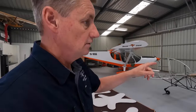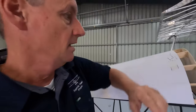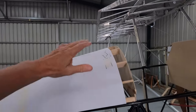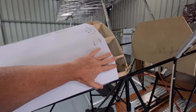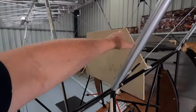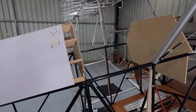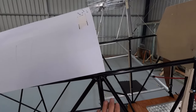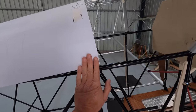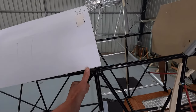I think I will try and get the plywood clipped out into place. I'm losing a bit of sleep over how to do the turtle deck. I think I might go back to sheeting this with aluminium because it's thinner. I want all this wood to be wood, or at least look like wood. From what I've seen on videos, it's got aluminium sheet on there. This plywood comes up and just basically tacks on. So if it's a quarter inch thick, you'll have a quarter inch step just poking out in the breeze - that's fine because it's a World War One aeroplane.